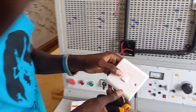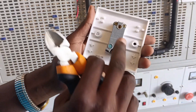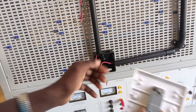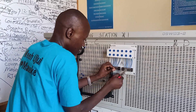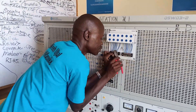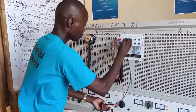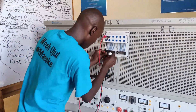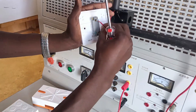All my conductors have been drawn — you can see the two: the live and the neutral. The bell push button looks like a one-way switch. The common terminal takes the live from the circuit breaker, and the live-one terminal goes from there to the bell.